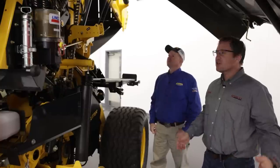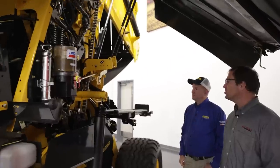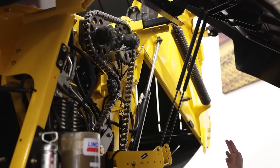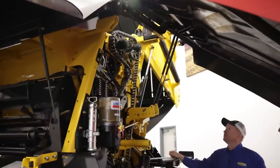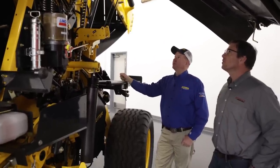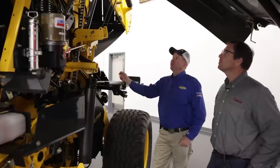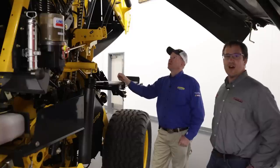As we move to the side of the baler, the first thing I notice are these massive sprockets and this enormous chain. What we've done is put two drive sprockets here to drive the rolls — we're driving the belts with two sprockets versus the one we've always had. These sprockets are 44% larger than the roll belt series balers. We did this for one main reason: it's about driving those belts in heavy, wet silage conditions, as well as taking the load off of one roll.